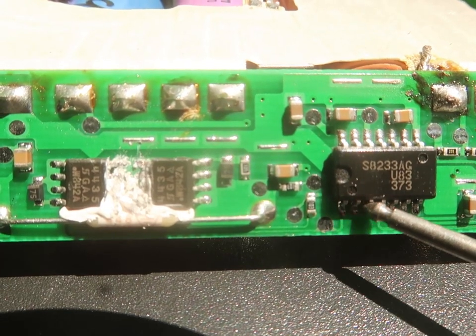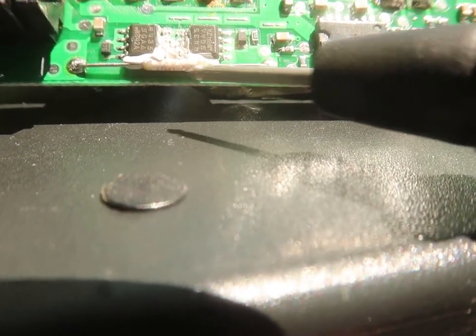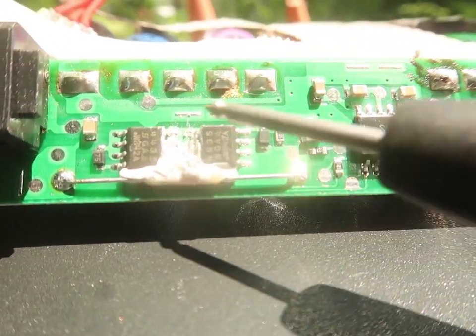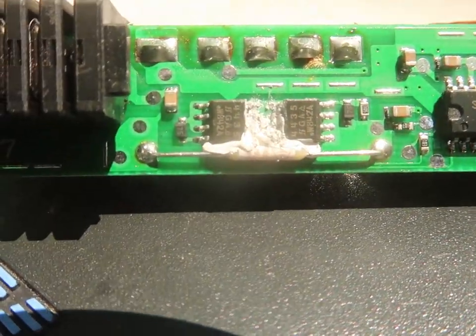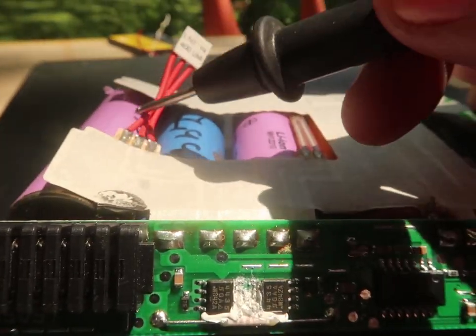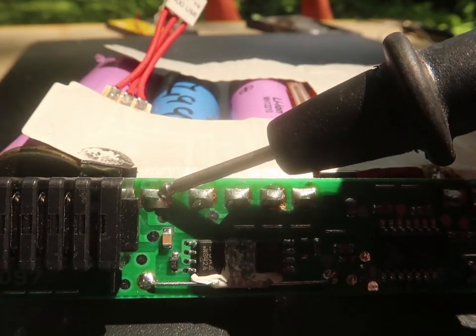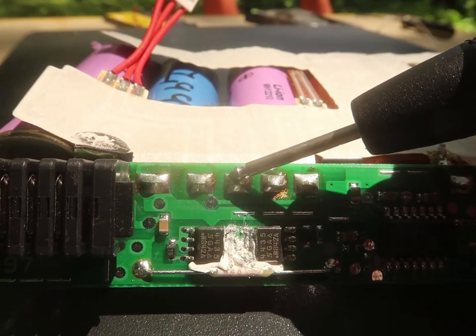I've traced the pins from one and two. One goes to this one, and two goes to this one. This is the discharge control MOSFET, and this is the charge control FET, or whatever it is. Oh yeah, it is a MOSFET, right. So these two aren't an issue, but I'm perplexed by this, because it seems like this is the main thing keeping this from connecting to this. So this is negative, and this is the power negative pin, and those need to be connected, and these two aren't low.